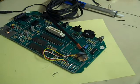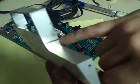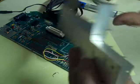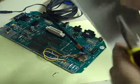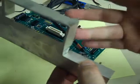So first things first, we've got the top shielding that we took off. And what we want to do with this, if we look there, there's a little bit that's kind of separate. If you look there, it's not fixed to the rest of the metal shielding. We take the pliers and just bend that up, flatten it down like that. We've created a little entranceway for our cables that we can route our cables out of there, and they're not going to get trapped under any shielding or anything.